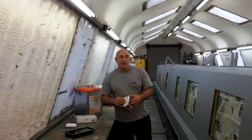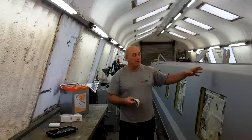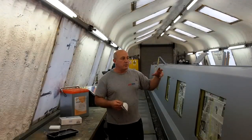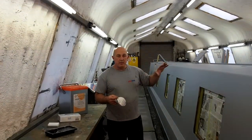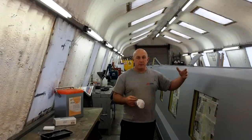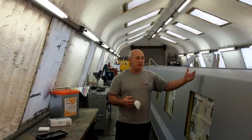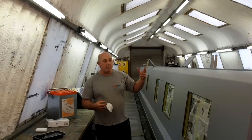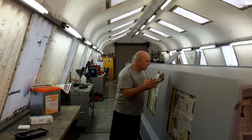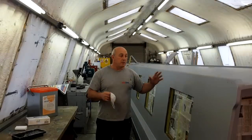We're in a warm workshop — always in t-shirts in here, never drops below 16 degrees. The surface temperature of steel is actually monitored daily; we take steel temperatures, air temperatures, dew points and so on. Not something you necessarily need to worry about, but if you're in a polytunnel or working outside, the steel can get quite cold overnight. If you come in the next day and the steel's cold with a bit of a damp atmosphere — just like breathing on a mirror — and as you're concentrating on your boat and painting close to it, the moisture from your breath is condensating on the surface. So it's not only your hands but your breath.